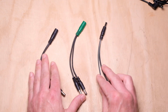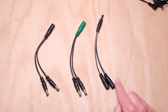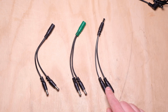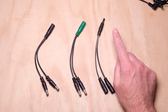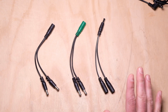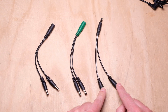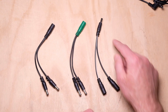The star of the show today is these cables, which generally don't come in the box — you have to get them after the fact. Starting with probably the most common: the port splitter. One end goes into a port on the power supply and enables you to plug two pedals into that one port. You have to make sure the total current draw between both pedals doesn't exceed the current capacity of the port. So if the port supplies 100 milliamps, you could do one pedal at 50 and one at 50, or 70 and 30 — it doesn't matter as long as the sum doesn't exceed 100. You'll also notice a white stripe down one side — this is ground isolated on that side, so there's only one path back to ground and you don't introduce a ground loop when splitting your current source.